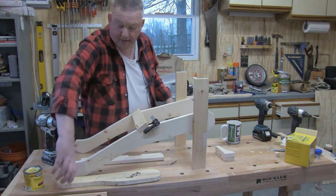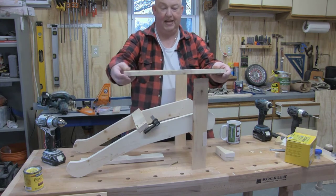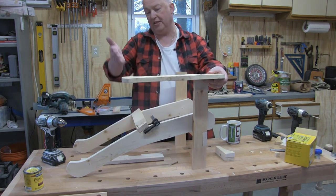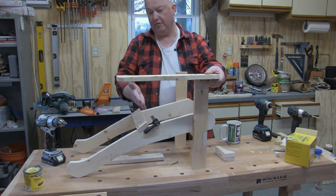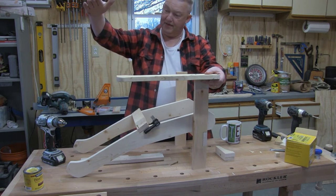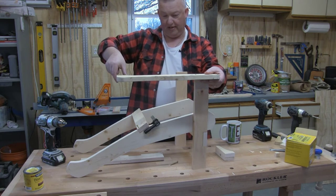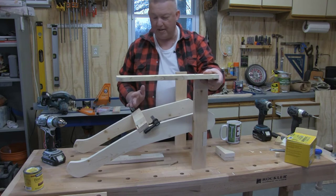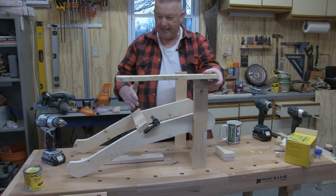The next part is tricky. Here's the arm — here's the template for the arm — which is going to sit on top of this leg strut like that. It's going to slope back, ending up about there. I'm going to screw boards onto here and if I've got that angle right they should come up to about the right height, and then we'll have a strip behind as well. I'm just dry fitting this right now — I won't glue any of the parts yet until I've seen it assembled.